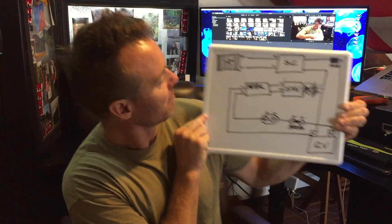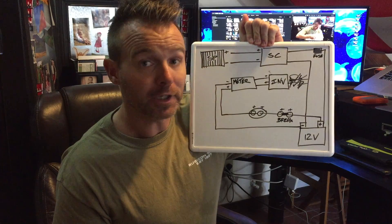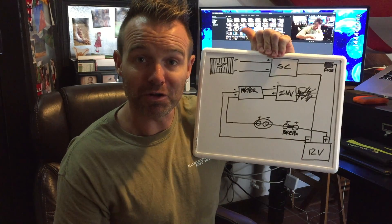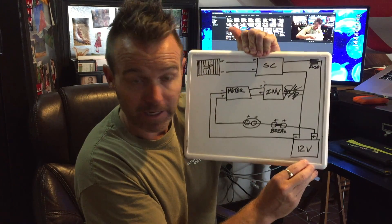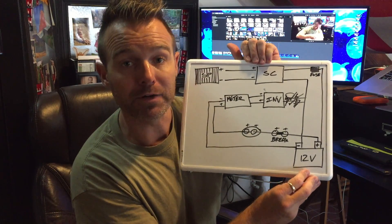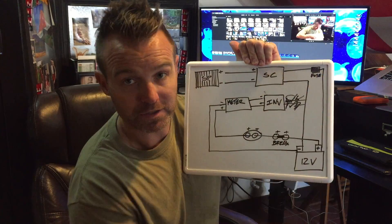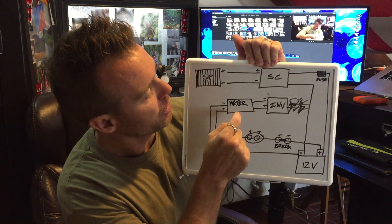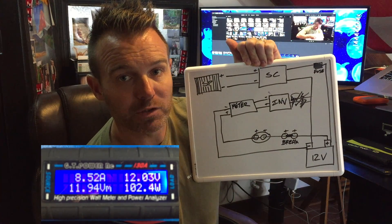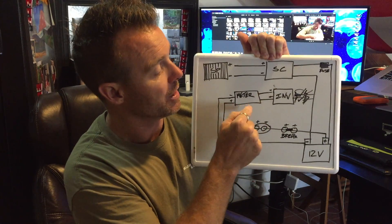Now let's look at how all the parts work together. I drew a nice schematic so you can follow along. First you've got your photovoltaic charge cells — your solar panel — which deliver the sun's juice to the solar controller. The solar controller controls the flow of electricity to your 12-volt AGM battery. Think of the battery as a gas tank — you can overflow a gas tank, and if you overflow a battery, bad things happen. The solar controller regulates the flow. Always put a fuse between your positive runs. The negative runs straight to your power meter — a cool little device that gives you a readout on amperage, volts, peak volts, amp hours, watts, and more.